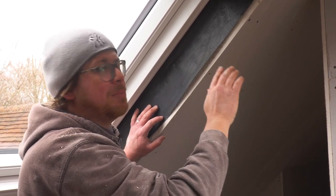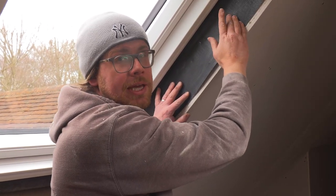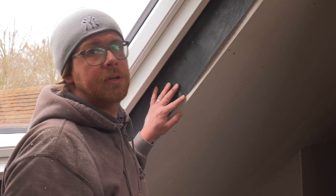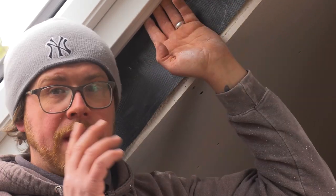This will be thermal board as well — we're not using plain plasterboard — because we've now got a cold bridge here. Even though we've got the thermal collar that Keylite put into their windows, we're still going to use thermal-backed board so we don't end up with any cold spots around the windows. The thermal collar in Keylite windows is important because tests show that if the temperature outside is minus five degrees, this bit of plasterboard could be as low as zero degrees on the inside. The moisture content inside from people breathing and moving around will naturally be attracted to that cold spot and start producing black mould. The built-in thermal collar on Keylite windows means you don't have that problem.